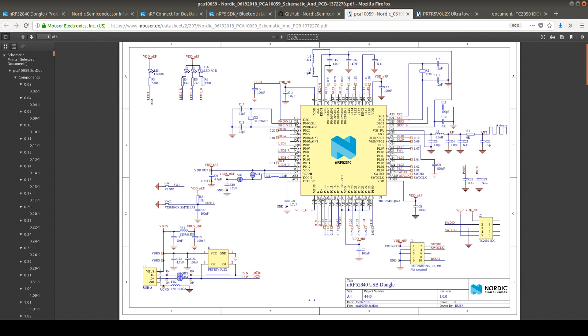One on my board is a red LED for indicating something, and also an RGB LED. We can control these with GPIO pins 6, 8, 9, and 12. We also have the antenna circuit here — there is a meandered antenna on this board.